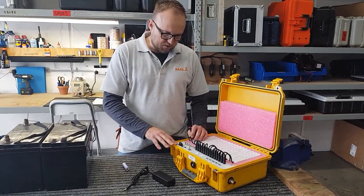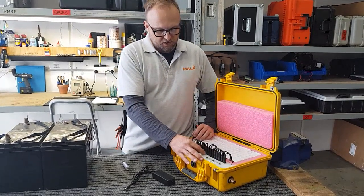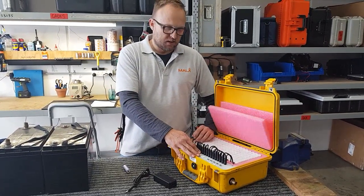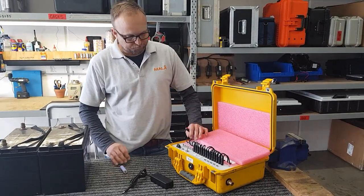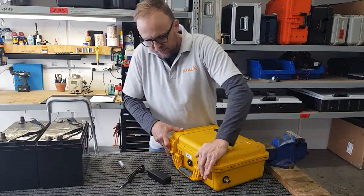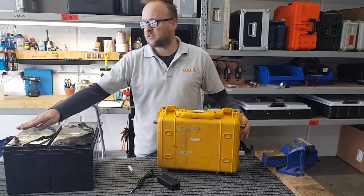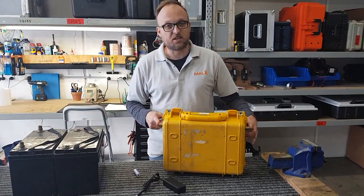At the moment I've got a 25 amp fuse in there. I really should fuse these individually as well, because inside we have 5 boards for charging that shouldn't individually really go over 5 amps. The way you power your equipment when you're in the field is with standard pole connectors here and here, which are exactly identical to these. Actually, the 2 missing here are now sitting on this box here.